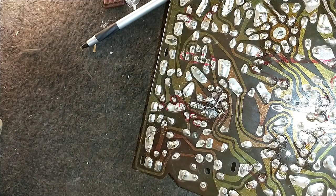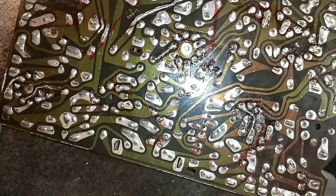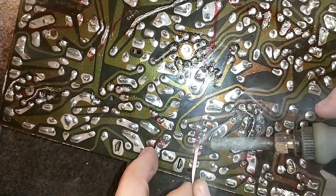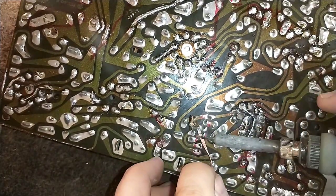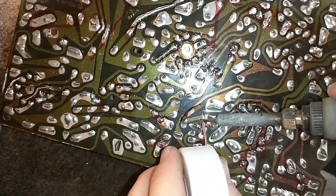All right, so all we have left is one big couplet, which is going to be this guy right here. And everything's kind of in a straight line, so it should be fairly straightforward to get it out. Then we'll take a look on the schematic to see where N4 and N1 really are as far as their part numbers, and then we'll see about replacing those two. They actually just look like disc capacitors, and they may very well be, so I'll have to take a measurement and see what the component identifier says about them if I can't find anything in the service literature about it.